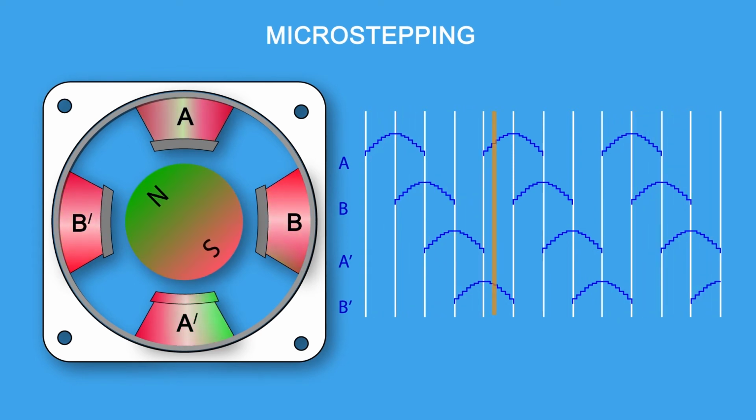There are some problems associated with microstepping, mostly accuracy and torque. Because the phases are only partially energized, the motor torque is reduced, usually by about 30%. Also, because the torque differential between steps is so small, the motor sometimes cannot overcome the load. In those cases, the motor may be commanded to move 10 steps before it actually starts to move.